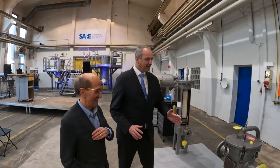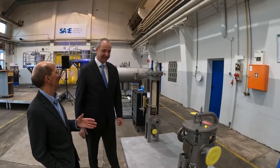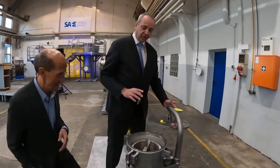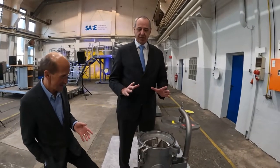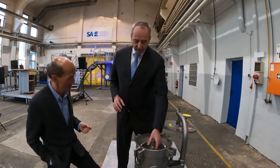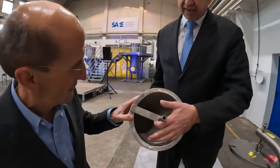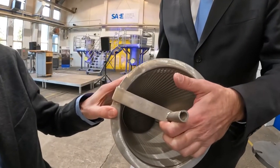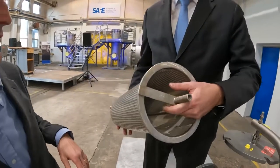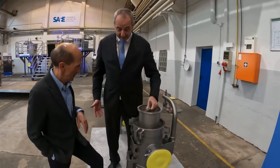What is this? Even I know that's a strainer, Marcus. Let's have a look into the strainer. What we intend to do here is to have all the setups of all the equipment like it would be in real life. Here we have a 200 micron mesh strainer, and you can see the mesh inside here and you can easily look through it — you can see your hand through that. And we want to train on this one here: how to install, uninstall, and how to clean it in a proper way.